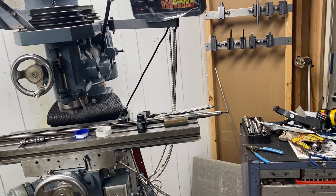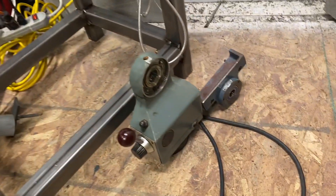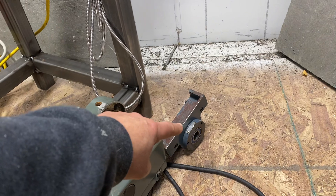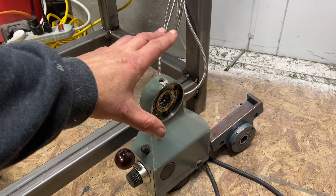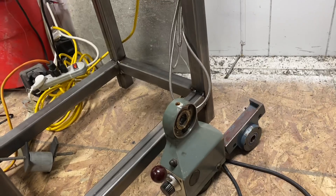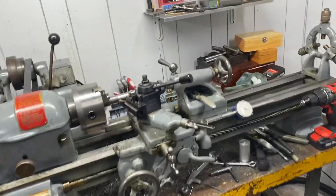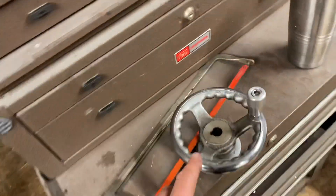When I left you last, I was working on this piece over here that needed to be drilled and tapped M6 to match these two bolt holes. This all mounts up on there and it looks super pro — nice and straight, everything's square. This is actually almost done. I just need to make the extension, and the extension does need to have a keyway milled into it to accommodate the hand wheel, since the hand wheel has a key on it.